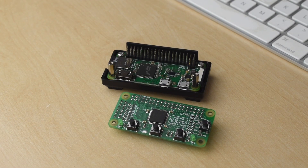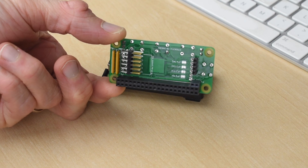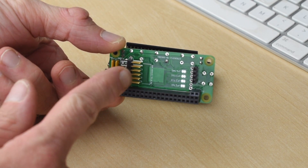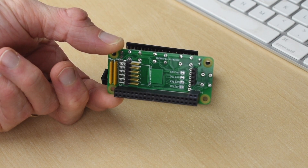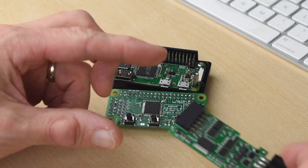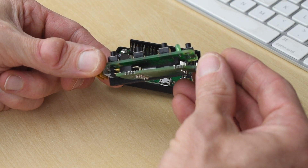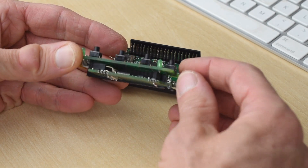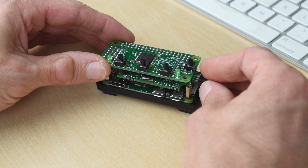But let's go for the big tamale and see if we can get it to work with the RGB to HDMI. The RGB to HDMI hardware consists of a Raspberry Pi Zero and the RGB to HDMI board itself, which has a connector underneath you can plug a cable into for the required input type. For the VDC output on a 128, I can connect a short cable with an IDC connector on one end and a D-sub 9-pin on the other. For sampling analogue sources though, you need the special analogue board, which plugs into the same connector as well as another connector a little bit further along. Once assembled, the two boards are fitted onto the header of the Pi, taking care to line up the pins, as an off-by-one can be fatal.